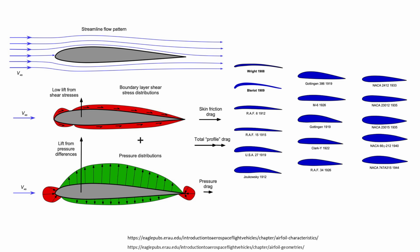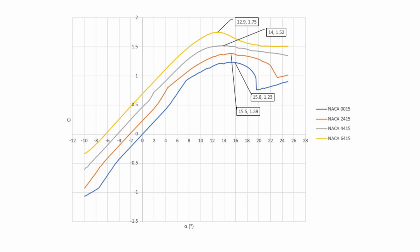If you get this wrong, you can easily end up with an unstable design from the start or one that deep stalls. Like we've covered, the canard needs to stall or hit its CL max before the main wing does. We can achieve this in quick 2D design stages by increasing the canard's airfoil camber. Remember that as camber increases, the CL alpha curve shifts to the left, meaning that the zero lift alpha decreases. The CL max will increase, but also shift to the left by some amount. We actually want both of these things, but we want them also on the scale of the wing, not just at the airfoil level.